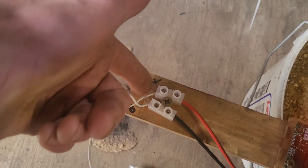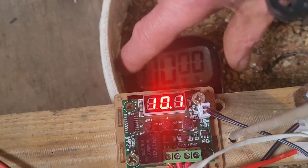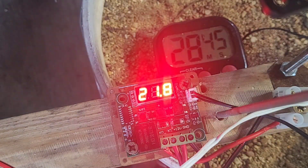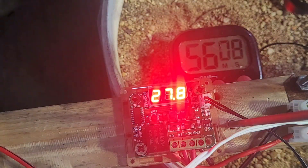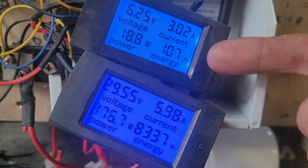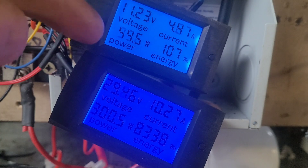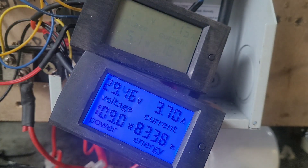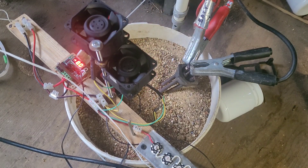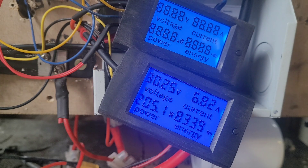At the moment it's connected to a small homemade lithium-ion battery, but the plan is to have it connected to the wind turbine battery. It's taking its sweet time — we need this to start getting hundreds of watts. It's starting to get a little bit windier. Once this starts getting up to a couple of hundred watts going to the dump load, it will heat up a lot quicker. I could speed it up by moving the temperature probe, but that would ruin the whole point. The ambient temperature is about 5 degrees, so the bucket is dissipating a fair bit of heat.